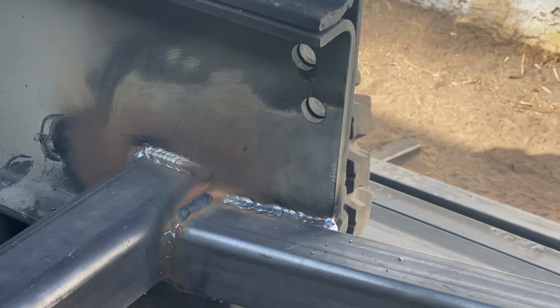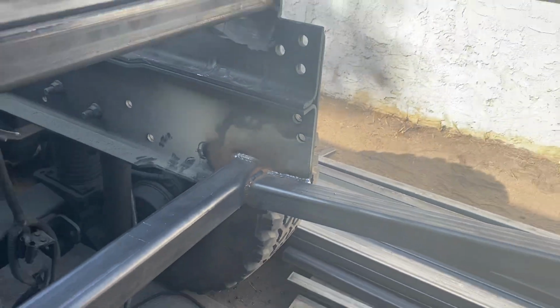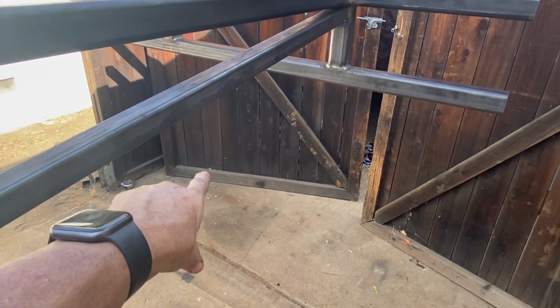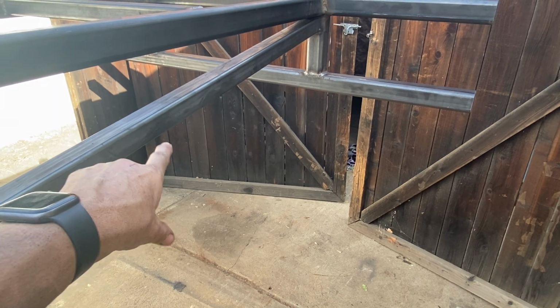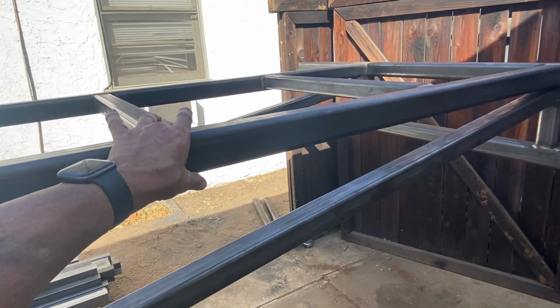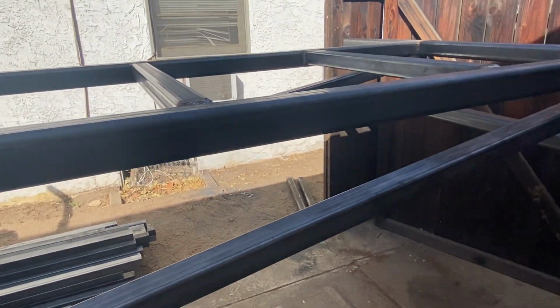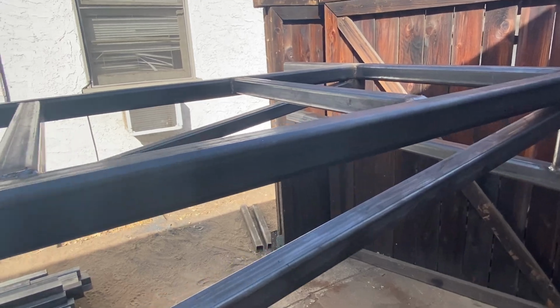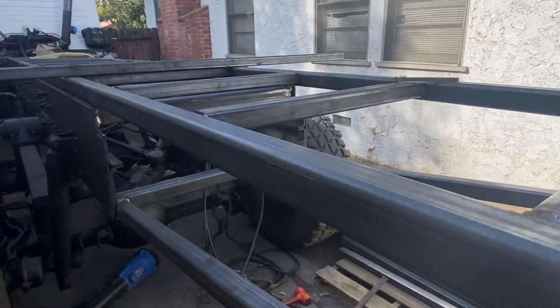So I did a cross member and truss this all in. I did put a little bit of an arc on this. I took a floor jack and jacked that up just a little bit. So there was about, maybe a 1/16 of an inch in this area right here in between on a flat piece. And so I put a little bit of bow in that for a reason, just to support all of that.